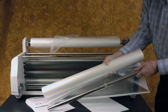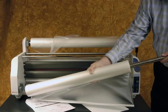Now repeat the procedure as you did for the top mandrel. On the bottom film position, the top metal point will be facing away from the operator and the film roll with the dull adhesive side in will unroll from the back side of the roll going up as you unwind it. Center the film on the mandrel and place the bottom mandrel back onto the laminator.